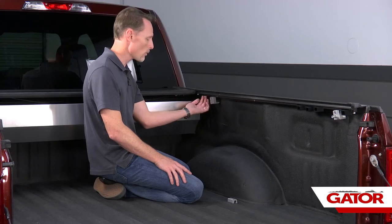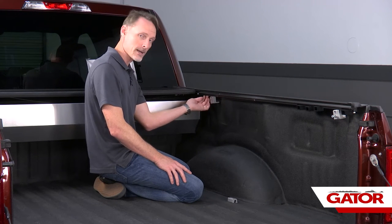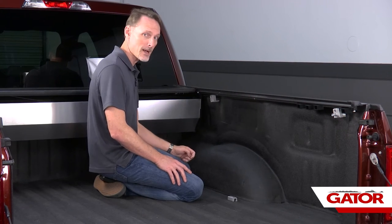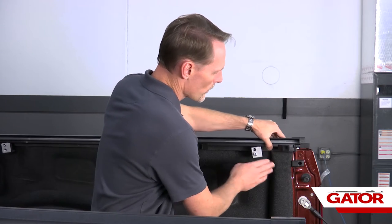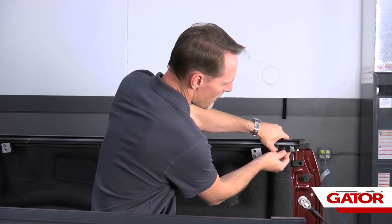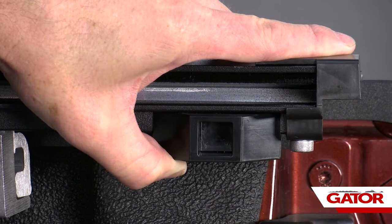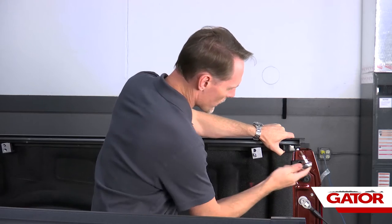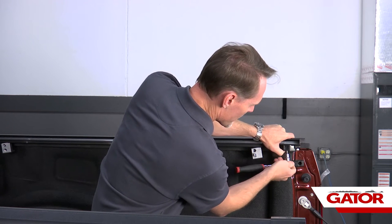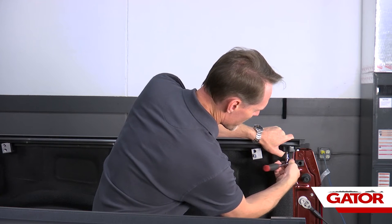We should have one last nylock nut in front of this clamp between the clamp and the canister, but we're not going to use that until we've already lined all this stuff up — then we'll do that last latch stop. Before we go any farther, we want to set the placement of this last latch stop. It needs to be about one eighth of an inch away from the end of the rail. Use a quarter inch Allen wrench and tighten that down, just snug it — you're not supposed to go past five foot pounds.